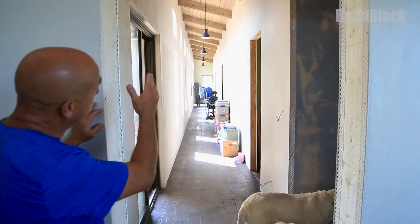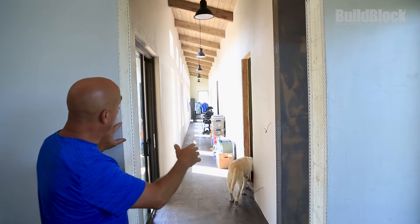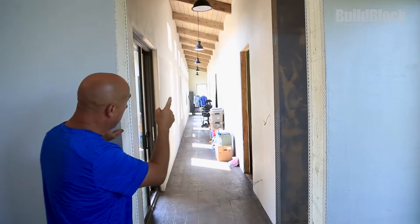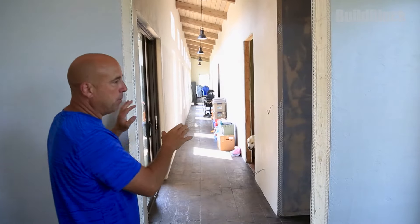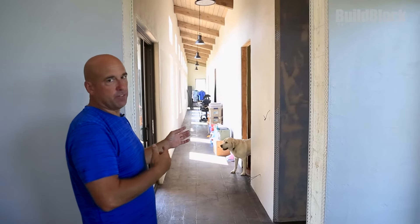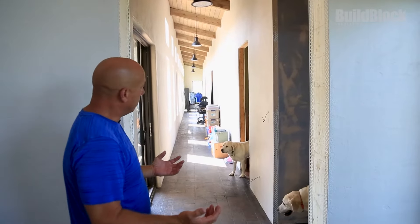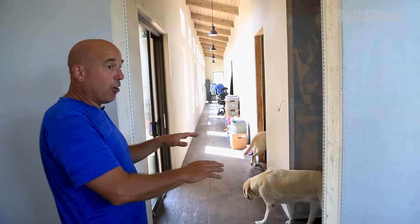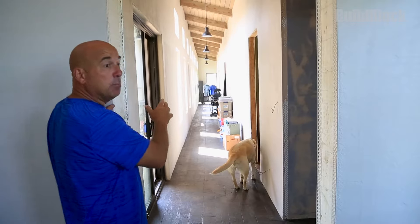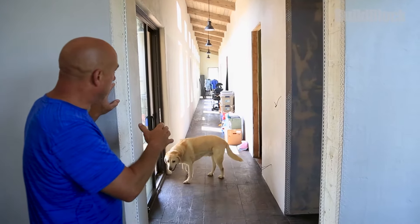This room is about a 20-foot span with 4x8s every six feet and tongue and groove. Every interior wall we framed is non-load-bearing — everything rests on the concrete walls. So technically someone could come in and remove this whole section; we could take the beams out and it would be self-supporting.